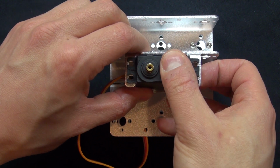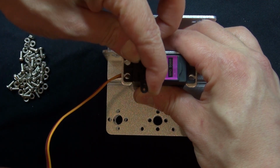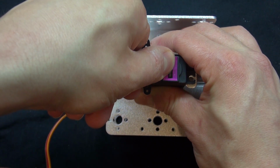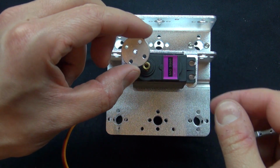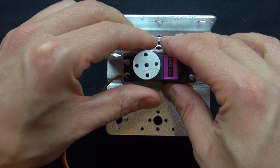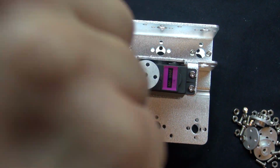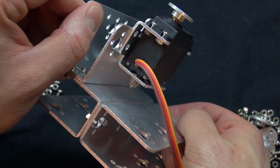Now you're ready to put in your servo motor, in this direction. What you need to do is preset your servo motor by rotating it clockwise to where it goes into a direction like this. And then you rotate it 90 degrees anti-clockwise, so it should look just like that. Now your servo motor is ready to use. Now you attach the servo connector, just like this. Next, put in your screws to hold in your servo motor. Total of 4 screws and 4 bolts. It should look just like this.